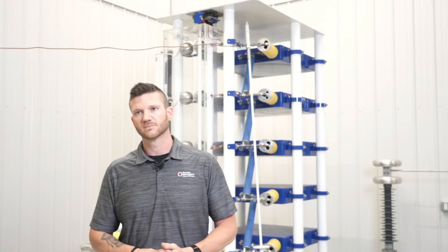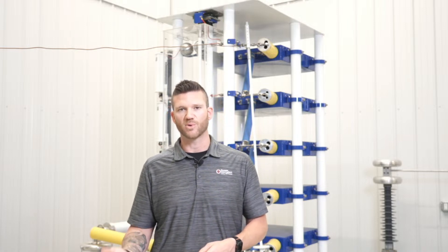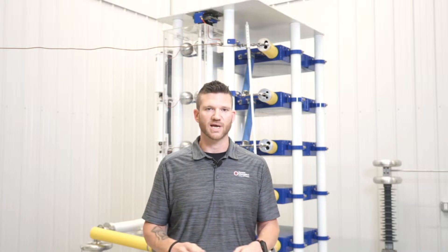Do you still need to perform an AC HiPot test? Yes. The MAC test set could take the place of the actual bottle integrity test, but as far as the over-potential test with a ground reference, that's still highly recommended. The MAC test set is not testing any other insulating values on your breaker — it's only testing what's happening inside of your bottle. With AC HiPot, you're still performing a withstand test on every component in the pole assembly. So yes, we still want you to do the AC HiPot and the MAC test set. Preferably, we'd want you to do the MAC test set first so there's no disturbance in the bottle before you run that test.